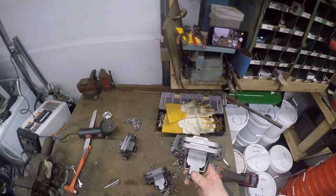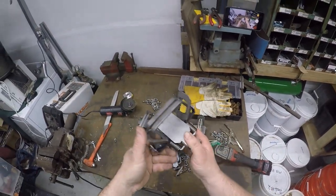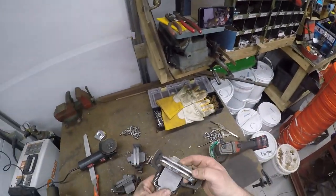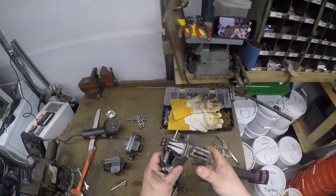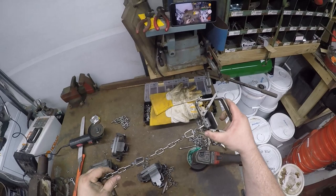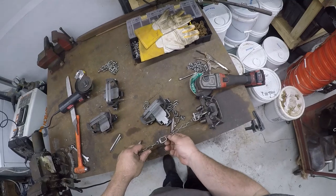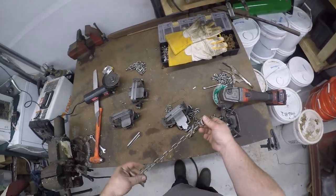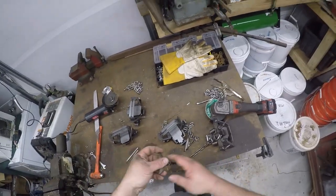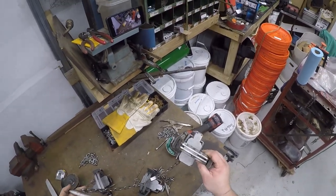All right, so we got 2 dozen new Bridger number 2 dogless. I modify mine straight out the box. I laminate them, weld the base plates, weld all the swivel connections. I put 6 links of chain between the first 2 swivels, and then 12 links down to the end. Then we anchor it with a super stake anchor, and this will do us for years.